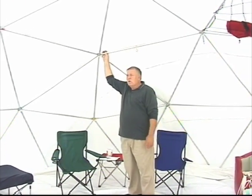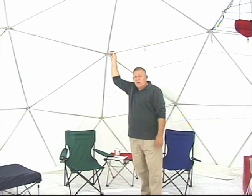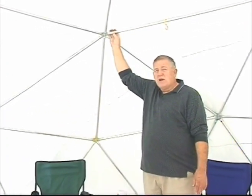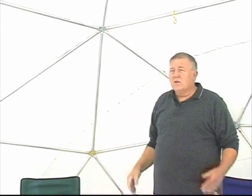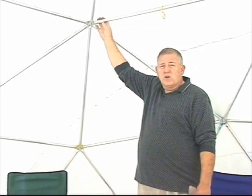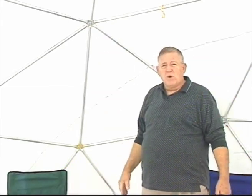Now, the frame material — we did quite a bit of research. There are several geodesic dome designs around, some very nice ones, but most are made out of steel. Steel is four times heavier than the aircraft alloy that we used. We met with a metallurgist and decided to make it lightweight without sacrificing strength. This alloy is four times lighter than steel and 87% as strong. The strength of this dome is engineered to take 150-mile-an-hour winds. Most of our houses will not handle that, as we saw from Katrina in New Orleans. We wanted a structure extremely strong and resistant to wind without needing lots of guy ropes like a normal tent.